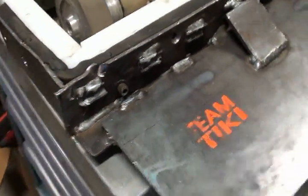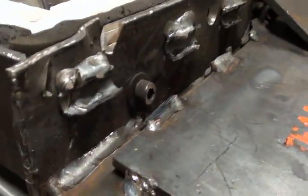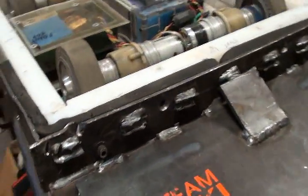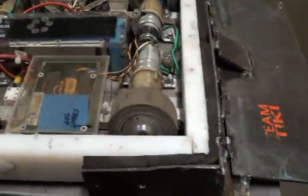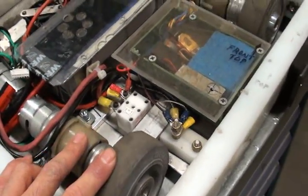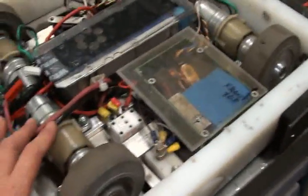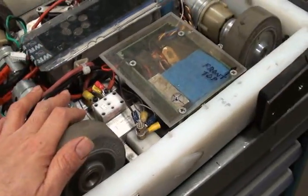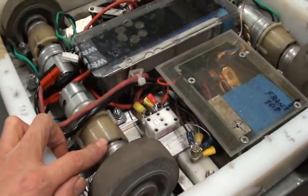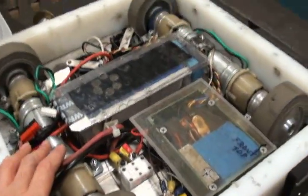You still have to pull the wedge off with two more bolts — those are also bent. The wedge hinge pin was the weak point in the fight. All of those bushings — they were sintered bushings, which was a bad material choice — basically shattered and the whole wedge came off. Teammate Dale had to emergency field-weld the wedge back on, and that's quite solid now. But the real weak point was the gearboxes. These are the Harbor Freight motors; we started with the $15 ones, then the now-discontinued slightly better ones as used in Dr. Inferno Jr., but in this arrangement they just did not hold up. The final stage output carrier kept shearing pins, and that was the downfall of this robot.